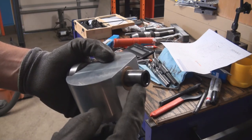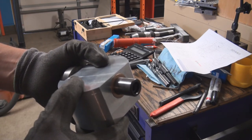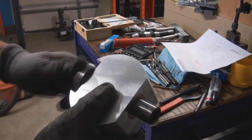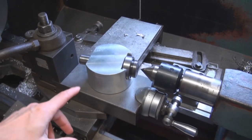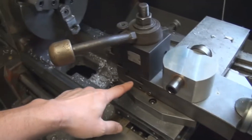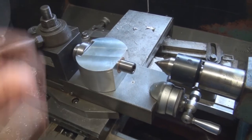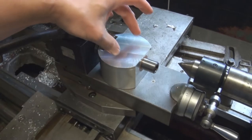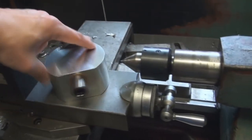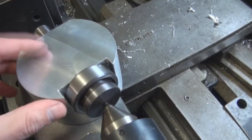So I'm gonna put the holder here, the bracket that holds the handle. I'm gonna squeeze it together so it's not gonna have any axial play. I'm just checking the correct height here. So the block is actually gonna sit like this, and it's gonna engage this slot. There will be two bolts here holding it down to this slot. And I was just wondering if it's gonna be the correct height. You can see it's perfect height.